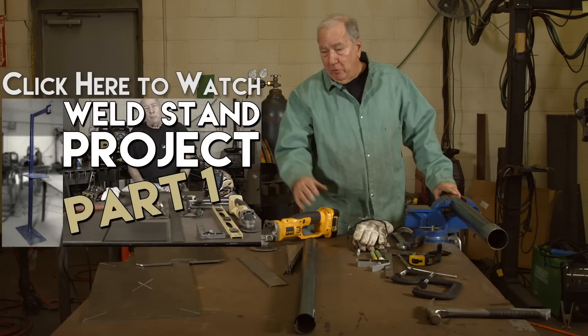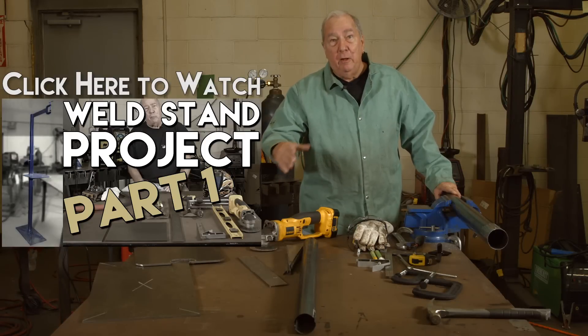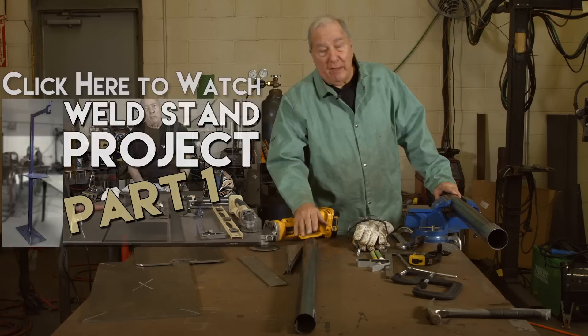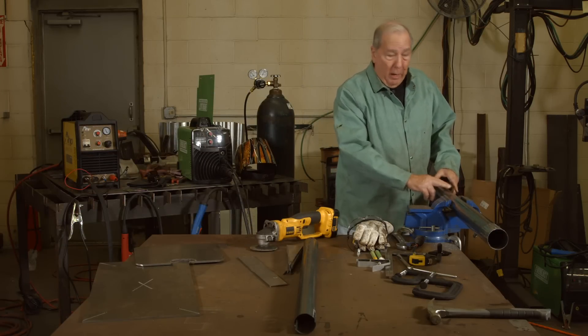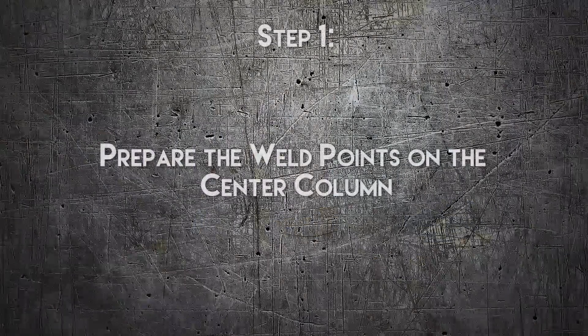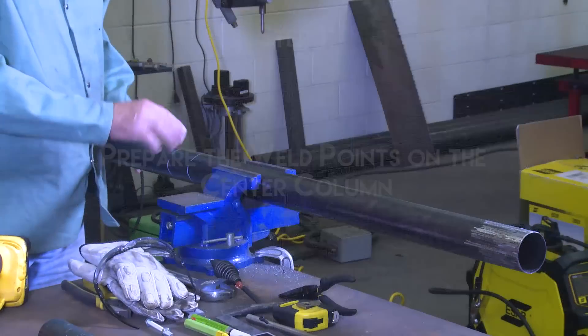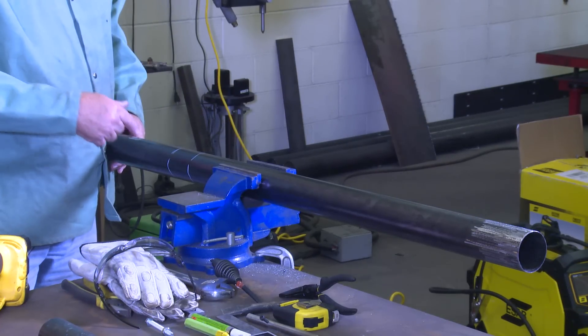In the past episode we did all the gathering of the parts, the cutting, the plasma cutting, getting everything ready to weld. And now in continuation of that, I got to do some work on this pipe. It has some type of coating on it. I'm not going to pretend to know what it is, but it interferes with the ground when I go to try to weld on it — the wire just stubs off and doesn't get a good arc going.